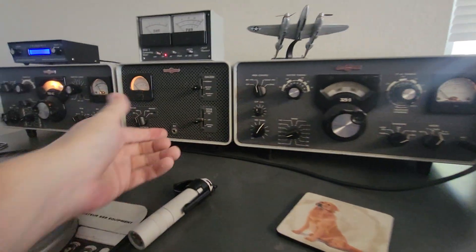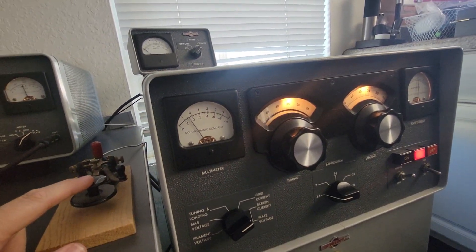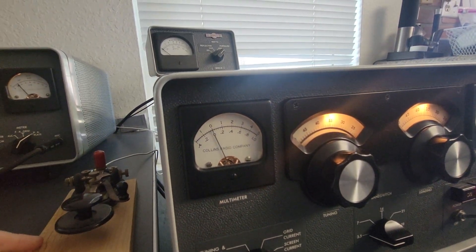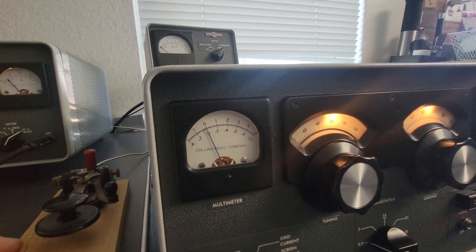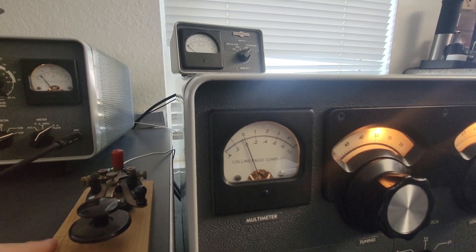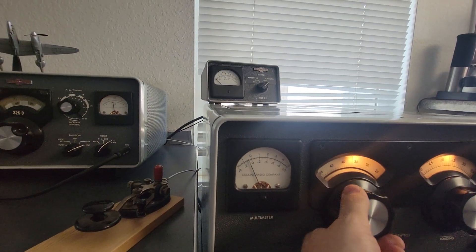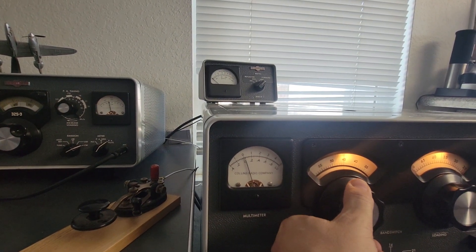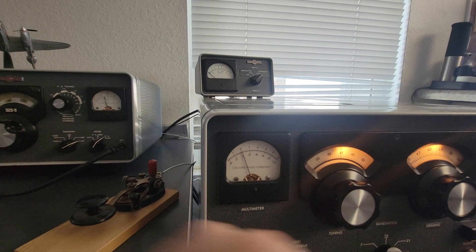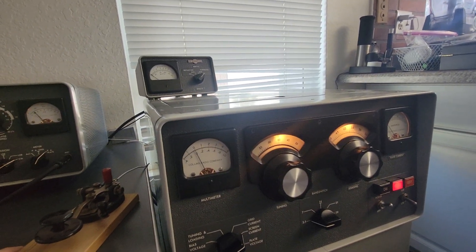Let's go ahead and key it down here. She's keyed up — I'm pushing the key. Now it's not in resonance; the amplifier is doing about 400 watts. I just wanted to show you guys it's pulling negative screen current — you see the meter deflect. Now if I lock this thing and peak this, you see that as I turn this, that screen current's peaking. That's what you want — peak screen current. That happens to be about 800 watts of CW there.